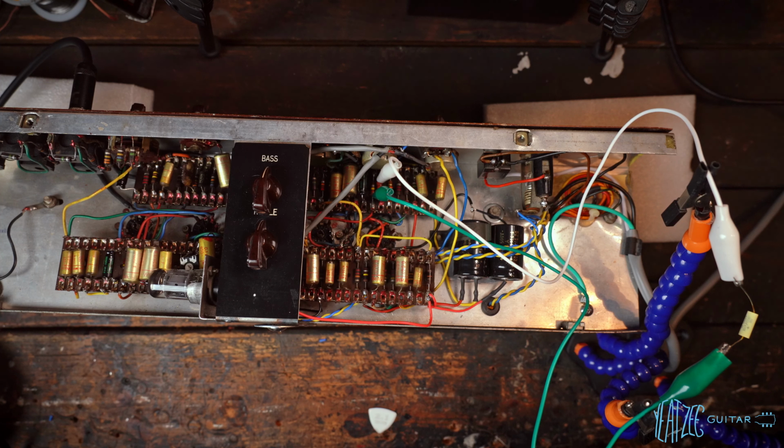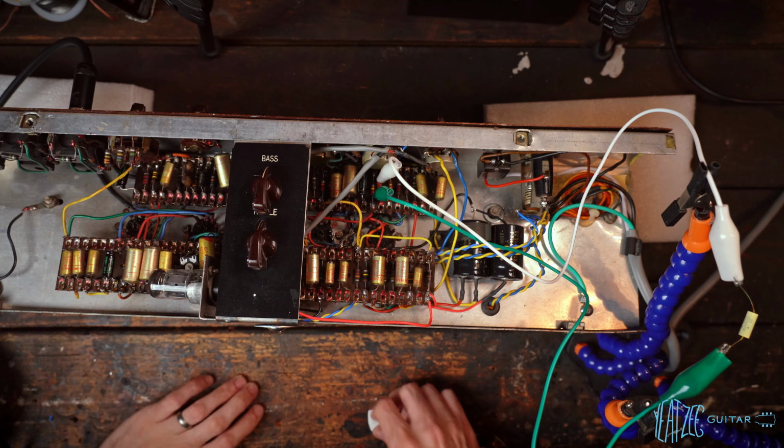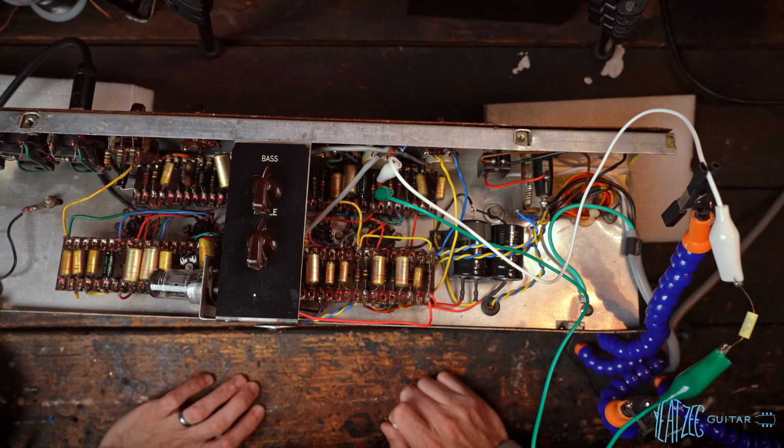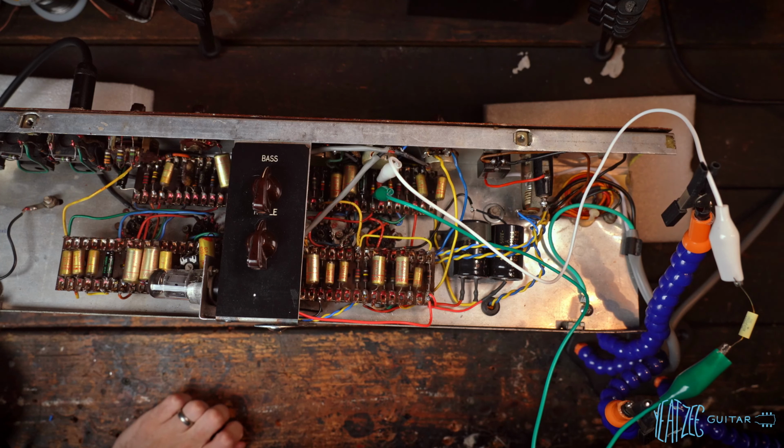So we're just going to go ahead and discharge the caps real quick, and then we'll solder that on top of the existing 500 picofarad, and we'll go ahead and test it inside with the aux box. But that was easy. Pretty stoked. First try. Love it. And that is a Mallory 150, by the way, that I had laying around. So anyways, let's go ahead and solder it in. So, discharging the caps to ground there. We'll go ahead and bring out the multimeter just to confirm values here.